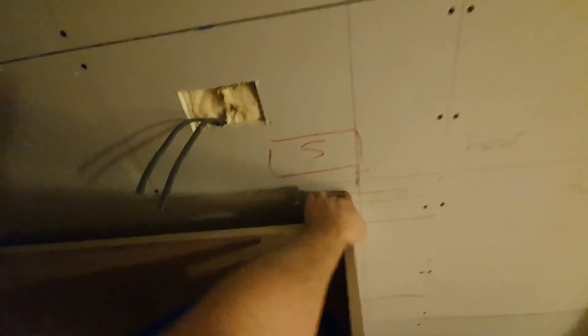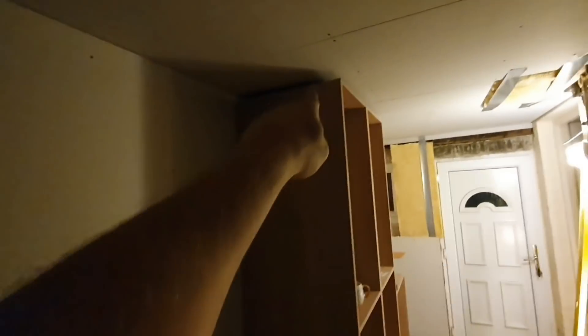The last job for these is the wall units. I'm going to make a plumb line up off this section first, send that up, then start a wall unit here. I'll do the other side after, making sure I get the level through off the top of that. I'll put a pencil mark from the top of this unit straight across - that'll be the top of that unit. I'll pencil line all the way through, plumb up, level up, and then hang them on the wall.